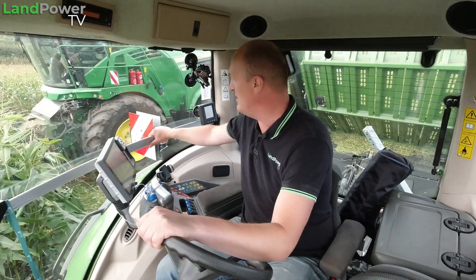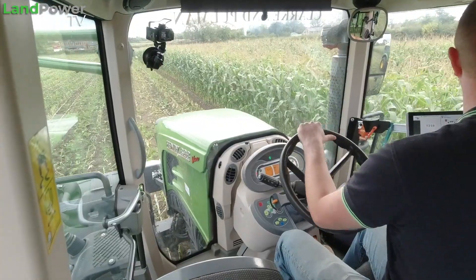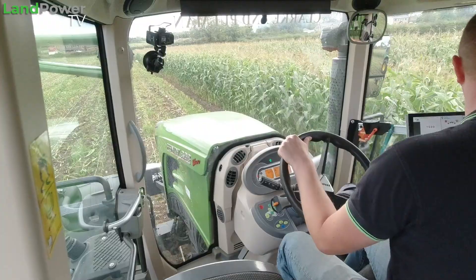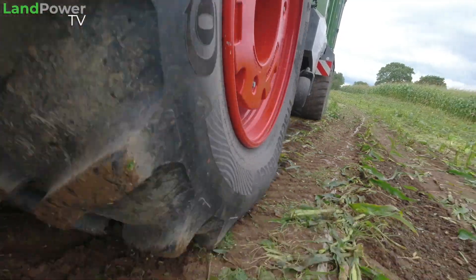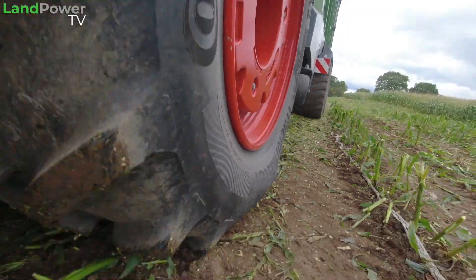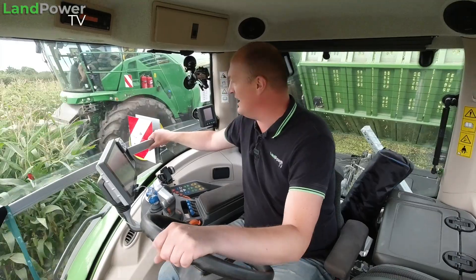For the rest of this video, I'm going to experiment with a few more different tyre pressure settings. We're getting a little closer to the farm now — a bit less transport duty. I'm currently at 1.4 bar, which was erring on the side of caution, and as we know it's now risen to 1.6. So next I'm going to try just 1 bar, which is 14.5 PSI, and then if we get really adventurous, I'll pop them down to 0.8 bar — 11.6 PSI — to see what that's like, especially when it comes to stability with this big wagon behind.